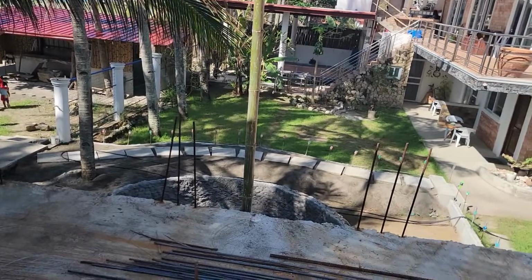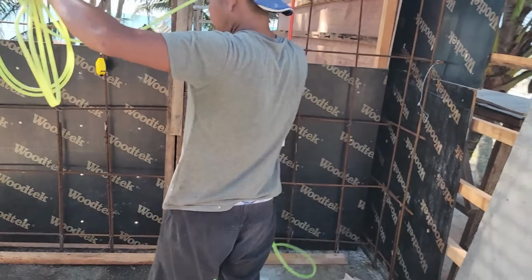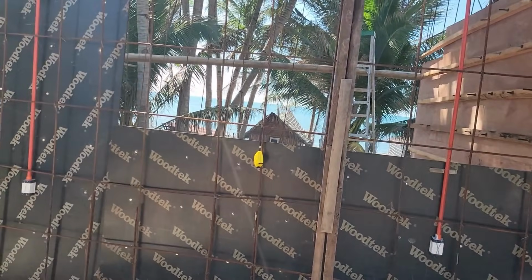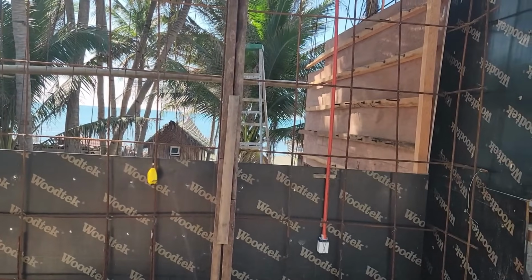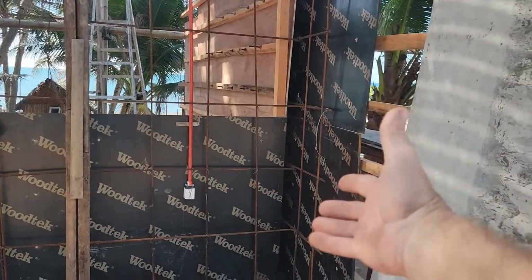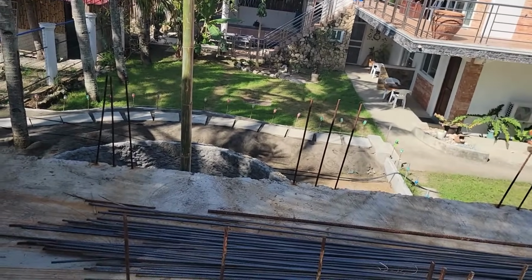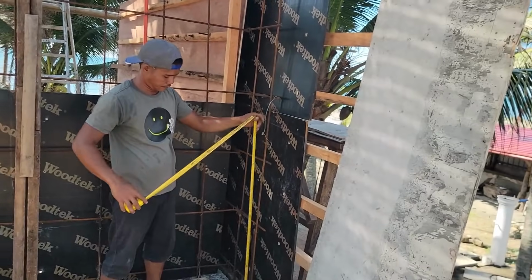We just pull them, and as we pull them, we place them. We don't just rip it all down and make it disorganized. Whatever we pull, we'll bring right over here and put right back up exactly the same as it just came down. So instead of stripping all the forms at one time and throwing everything down, we'll pull the bottom sheets and the lumber, wipe it down, bring it right over here, and put it right back up. That way we can just keep ad hocing it along.